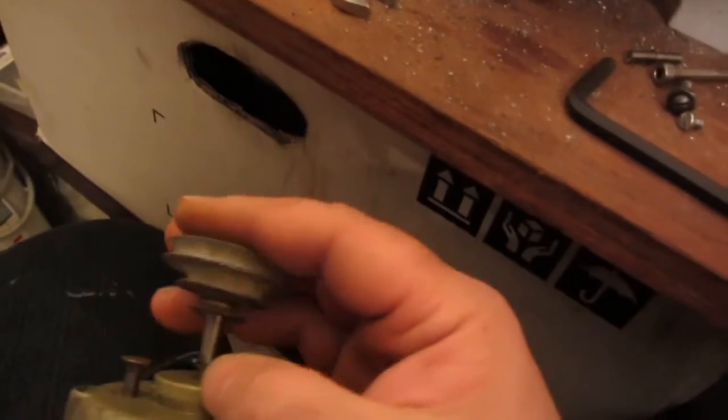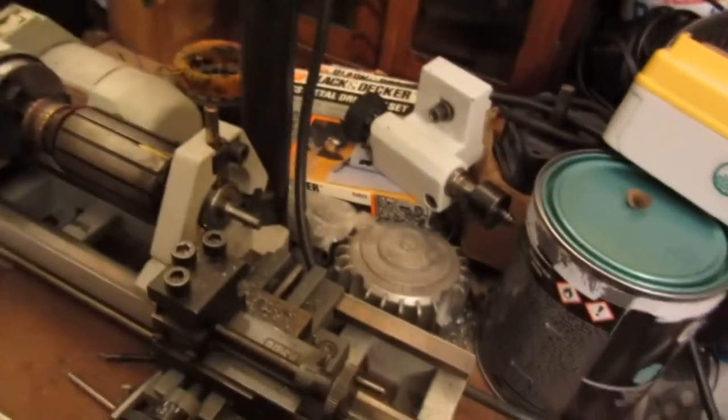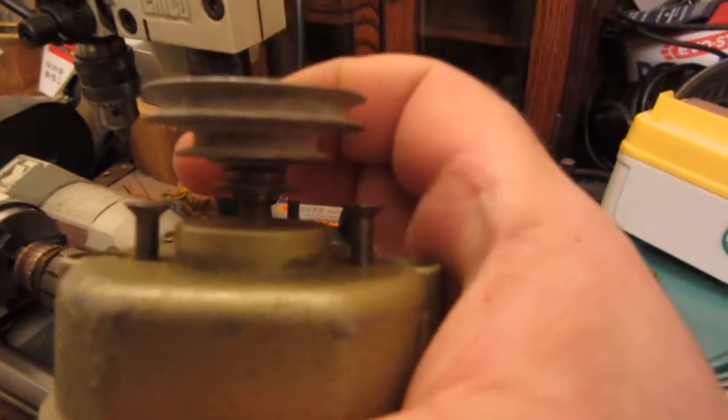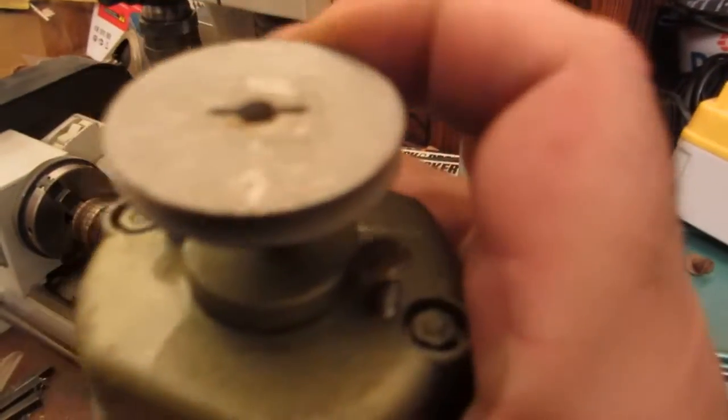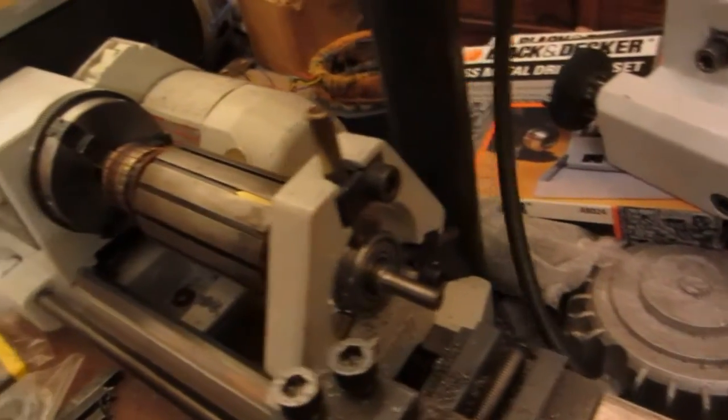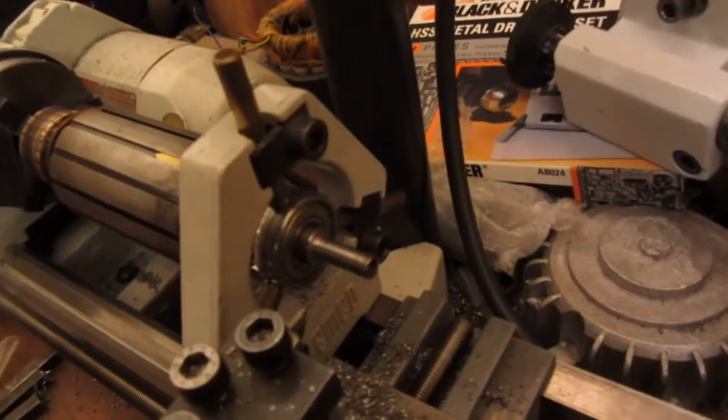If I push this on together like that, it engages into that slot and locks together. What happens is it stops the motor shaft from turning while it's driving the lathe — otherwise the motor shaft would just turn inside the pulley and it wouldn't be any good. So this is how it works. That's it for now, guys — this is just the follow-up to show you what I did and how well it turned out. It didn't come out too bad.